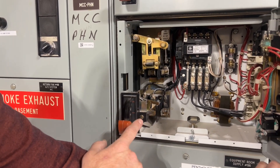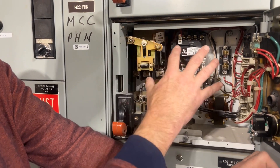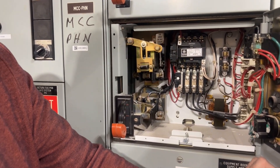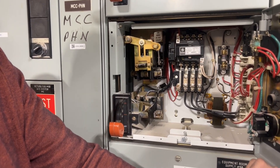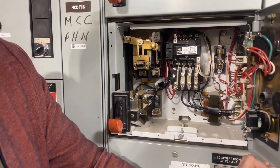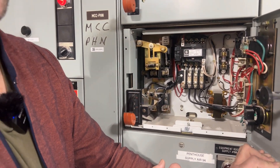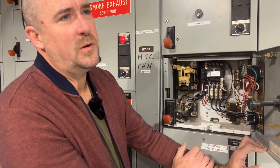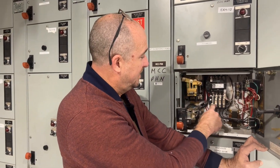You'll have your line side and your load side on this master switch, and that will ultimately go into this breaker. The bottom side of the breaker is going to be another set of safeties, which are time-delay — what's called heaters. Those heaters can absorb shock from the electrical system without blowing if there's any small anomaly.